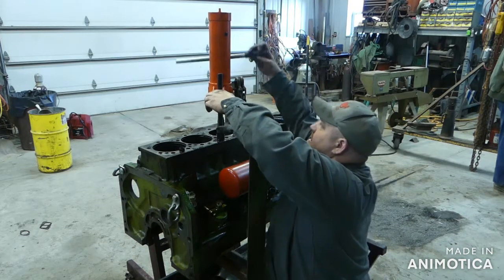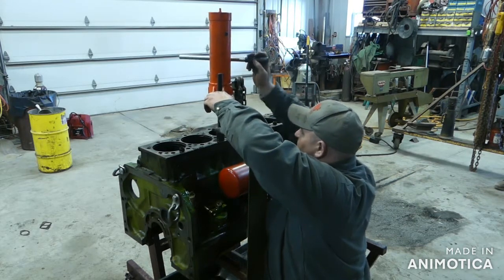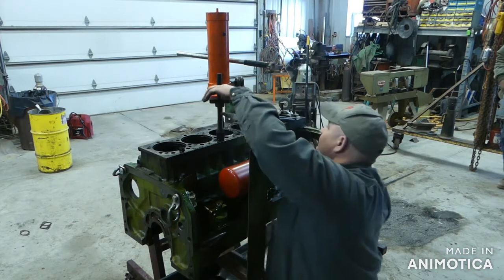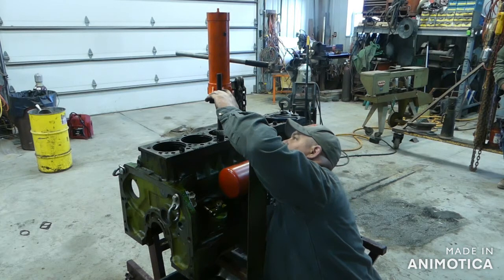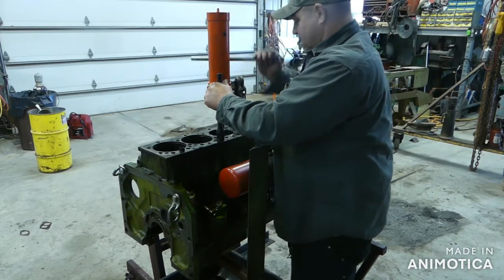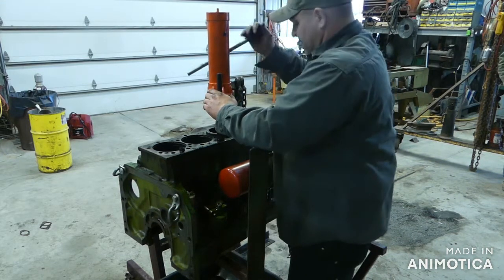I want to do it on an inline — I'm a little low here. We're gonna pick it up a little bit and see if we can get it at the right spot. There's just a wedge in the bottom that snugs out tight. Loosen up just a little bit, tighten this up again — yeah, that's a pretty good spot right there. Loosen it up until the jaws are all touching. Basically, pulling these liners is pretty simple — a little bit of pressure and she jets right on out.